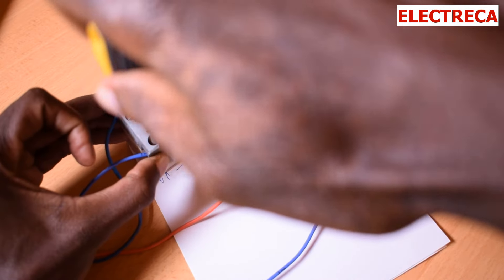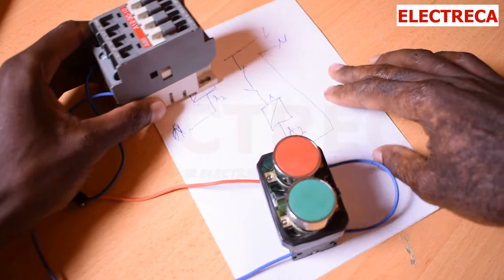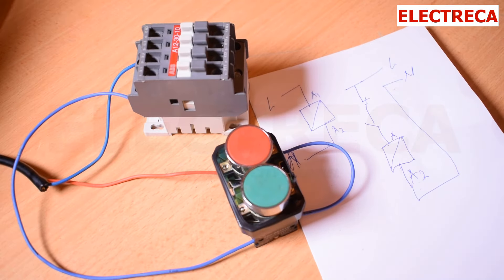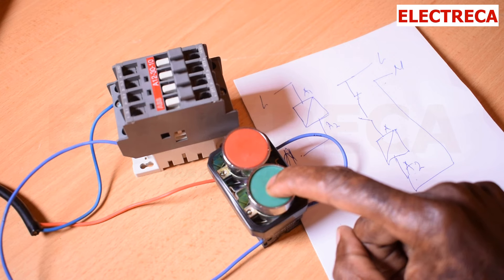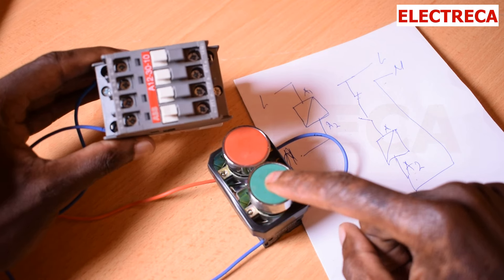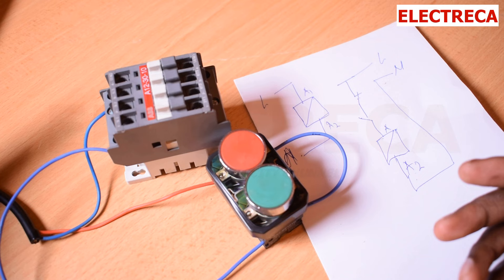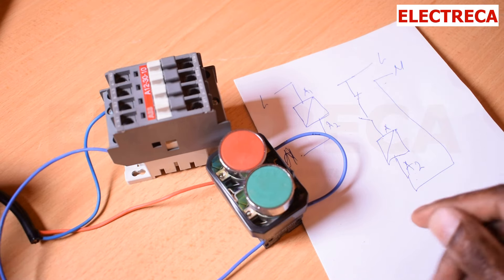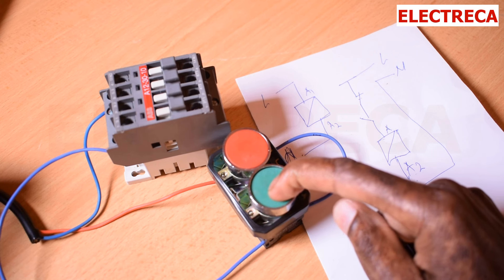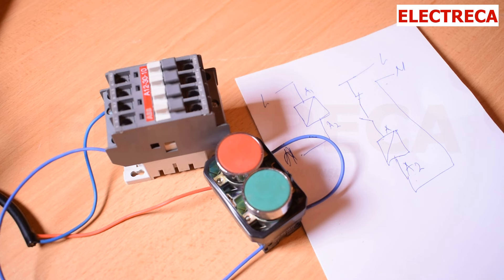Learn how to make a self-holding circuit. Our circuit is still here; we've done exactly that. Now let's get our power. Our contactor is right there — now you press Start. Hope you're able to see that. You won't keep pressing the start/stop push button. It's only in certain configurations where we don't need retaining, but here we need retaining — that's the holding.